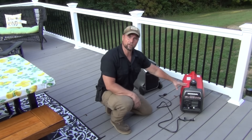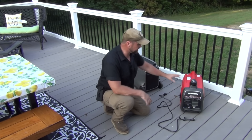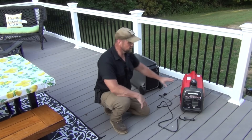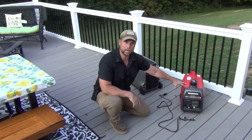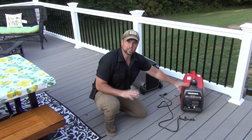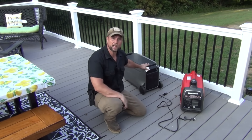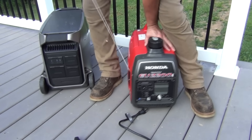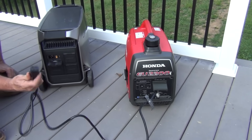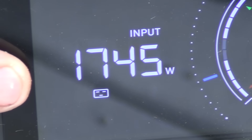For those of you that do have a good working generator and you also have the EcoFlow, there's something that you can do. If you run a generator continuously — this is a 2,200-watt, so it's not nearly the 4,000-watt capacity that this is — it would take a long time to run things off your house all day. But since this unit charges in only an hour, you can easily just run the generator long enough to charge the EcoFlow, and then you're good to go all night long. All we have to do is start the generator, plug it in, open up the port on the EcoFlow, plug it in, and now we have an input of 1,745 watts, which will charge the unit in an hour or so.